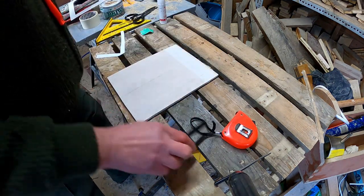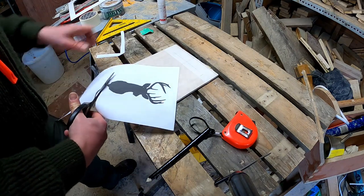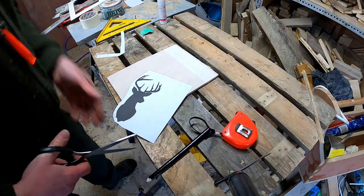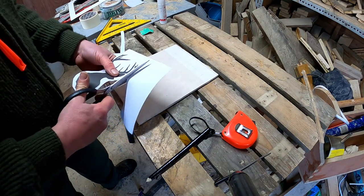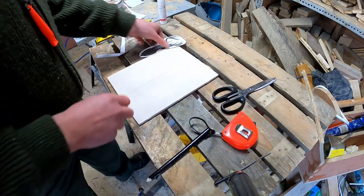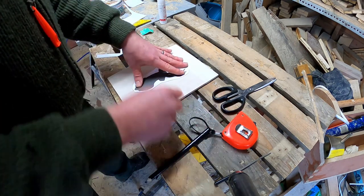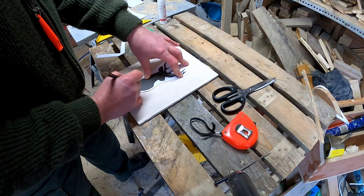You can just about see that. From this pattern I'm going to cut out, just to help me fit it all in nicely. It's not too close to the outside line where I'll be cutting round with the scroll saw, otherwise you'll find the paper pattern itself starts to lift off and makes life a little more interesting for cutting. So there's my line — we're going to be aiming for about there. To help me line it up again, I'll just put a few more lines here and there as references.